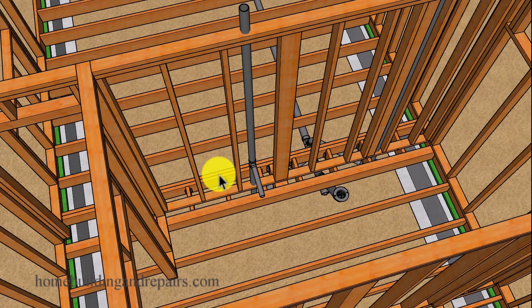And if you have the room you might need to install a wider joist. For example, if you have a 2x6 you might need a 2x8, or even a 4x8 or a 6x8. These boards might be extremely difficult to get in with all of the plumbing or whatever you have in the way that won't allow you to install a concrete footing.